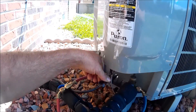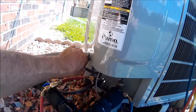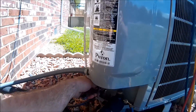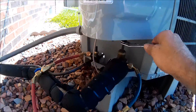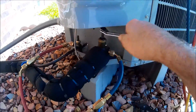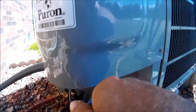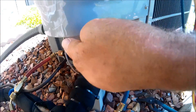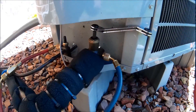I'll get this liquid valve closed, then I'll partially want to close that suction valve too — man, that thing's got a long stem on it, it takes a while to close. We'll get it started, about a quarter of the way shut. Alright, let's go inside.